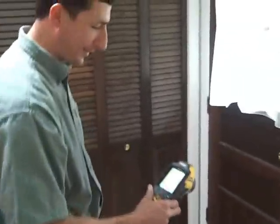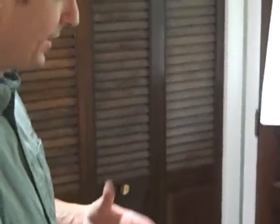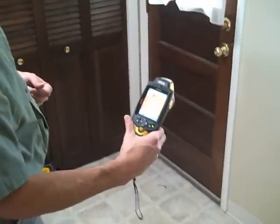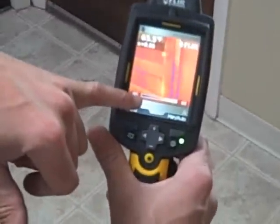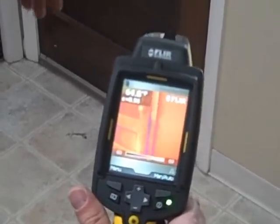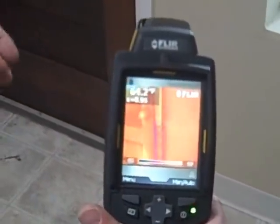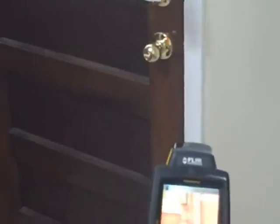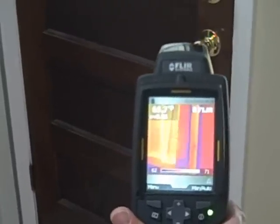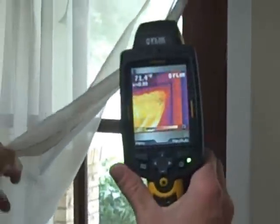This is an infrared camera, and what it's doing is taking a reading of how much heat is being radiated from objects. Heat is basically a light wavelength, and it turns that into different colors for different types of heat. Down here at the bottom, you see the temperature scale — dark is 60 degrees and pretty close to white is 69. You can see the dark rings right around the joint there, fanning out, which shows the air coming in there and cooling off that trim. You can also see the big change in temperature where the glass is — single-pane glass doesn't hold very much heat back. You can actually see all the leakage around there.